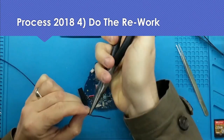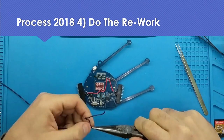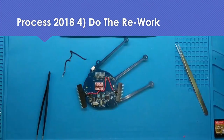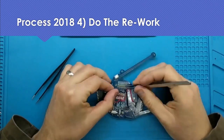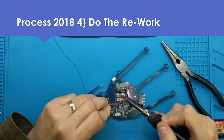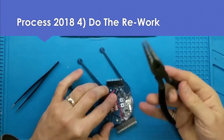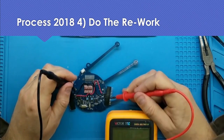Now we're going to connect up the ground snake — same technique. The 0.1 inch socket headers I've connected to those pin headers go on there so that when you apply heat to the pins, the plastic around the pin gets pretty liquid. If you don't have the socket headers in place on the outside, the pins can float and get crooked, and then you won't be able to connect anything to them when you're done. You can also put it on a breadboard to make sure everything stays nice and aligned. After connecting, always test for continuity — it's way better to do it now.